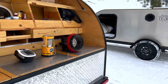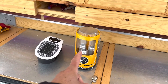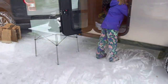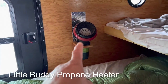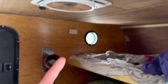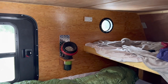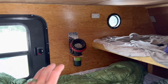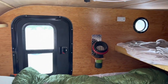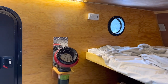We pretty much tried every way of heating these trailers, from candle heaters that people have recommended, to inverters with electric heat, to the Little Buddies. Over here we've got a Little Buddy heater and it works pretty good in a pinch — good for a day or two. We've got ours pointed towards the roof vent. It's an indoor safe heater, quote unquote, but we're a little scared of it because it's burning propane indoors. We recommend running it at night before bed or in the morning when you wake up, pointed towards the roof vent, and use the vent when running it just to be safe. Out of extra paranoia we also put in a carbon monoxide detector just in case.